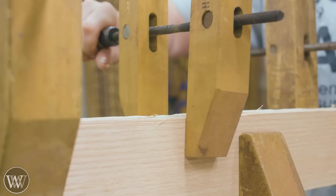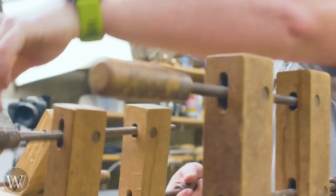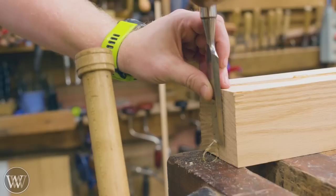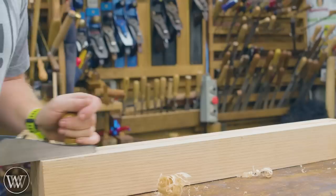I'm going to use all of my hand clamps - I have enough to do two legs at a time. Every day I would come down, switch out a pair of legs, set those aside, and clamp up the next set. Once these are out of clamps, we need to go about actually squaring them up and truing them, because they still have rough saw marks and we need to get them down to flush, as well as a full three inch by three inch.